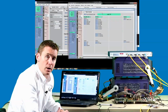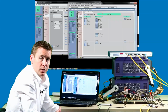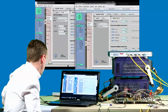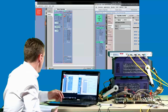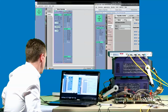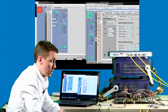So finally, moving all the way down to the SDH layer, we can now transmit and receive errors and alarms from both sides of the link and watch as they ripple through our design. If I start with the 100 gig side and insert a LOF error, we can see that reported on the 10 gig side. Similarly, if I inject a B1 error, again, we see that reported on the 10 gig side.